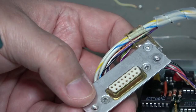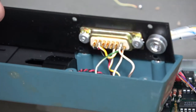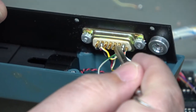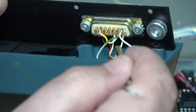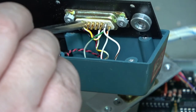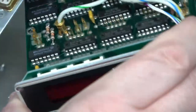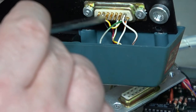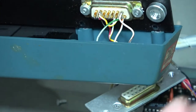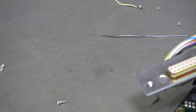The hold button signals to the main body - Tektronix call it a 'mainframe' - to do a sample hold on the output from the photodiode. There's also a little link between two of the pins: one is common with the switch, and the link comes across to another pin. This will tell the base unit what type of probe is attached, or it will actually just set the scale, since the device has different types of readout. That's how the probe communicates its correct scale back to the mainframe.